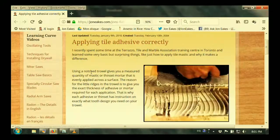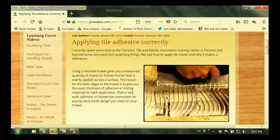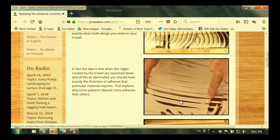I want to look at something on my website about applying tile adhesive correctly. I used plexiglass tiles, which is exactly what she wants to do, so we can see her problem. Whether using Mastic or thinset, when you run the spatula through it makes these grooves, and when you push the tile in they spread out. Every tile specifies a certain kind of trowel with certain notches and the type of adhesive to use.